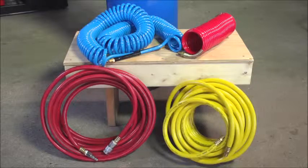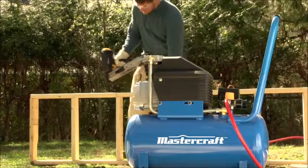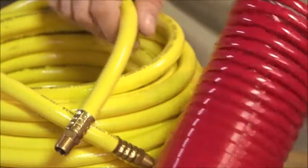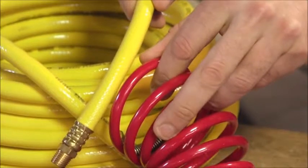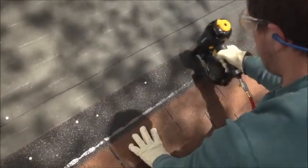Another item to consider is the air hose that the air tool is connected to. The hose can be as much as 50 feet long. This lets you keep the compressor in a handy central area. Air tool hoses come in two common diameter sizes: quarter inch and three-eighths inch. A larger hose will quickly fill an air tool like a nailer, allowing you to work faster.